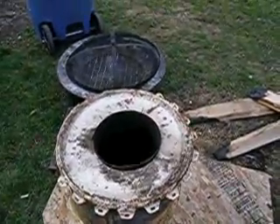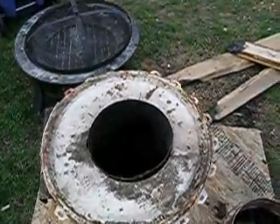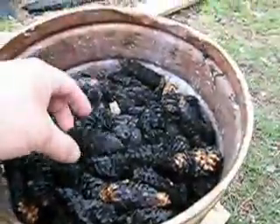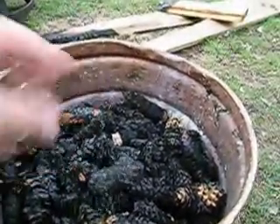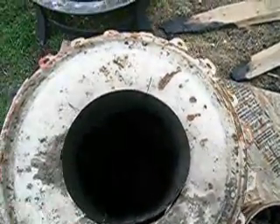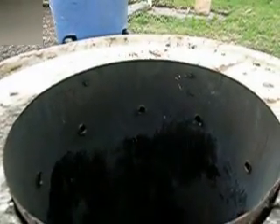Today I'm going to make an adjustment because it didn't quite biochar all the way. I ran another batch of wood chips and also a batch of pine cones, and they did better — they charred further down. I also removed the lid; all I have is a wire spider web down there. The adjustment I'm going to make is to enlarge the jets — the gas jets at the top. We'll see if that improves the function.